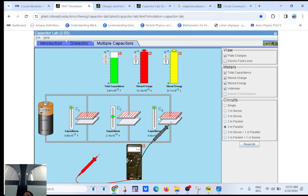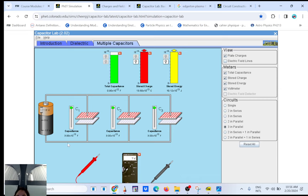And that was the secret when they built those Leyden jars. I don't know if you remember Humphry Davy. He took all those capacitors and connected them in parallel, so he had a huge capacitance, a huge charge, so a huge spark when it was discharging. You see how it works? A very good question. Series is the opposite, so I'll show you that. But let's try to memorize.